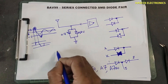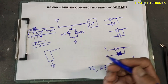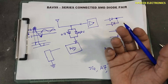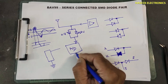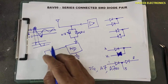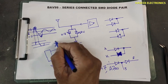For example, if we are connecting any type of sensor, where one end is ground and the other is the signal, and we are connecting to an A-to-D converter - because A-to-D ICs are very sensitive and if a high amplitude signal reaches them it will cause damage. So to protect the ADC, this BAV99 or any diode pair is used here between the signal line and ground.